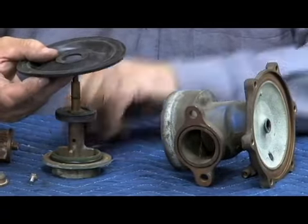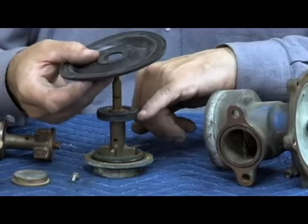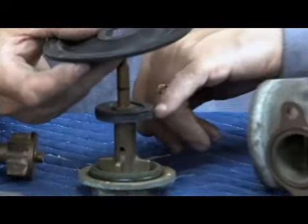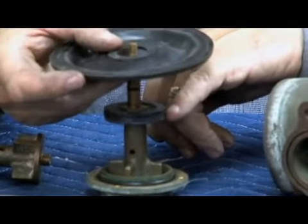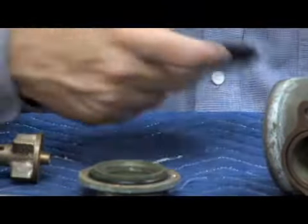So by putting the plastic material in here, they thought there wouldn't be as much issue. They also went from an O-ring design. In other words, the original version, this was an O-ring. If you look close up here, this is actually a quad ring or a square ring. Yes, there is a quad ring. We talked about those earlier. And this is a quad ring example. Still had issues with the relief valve opening point.